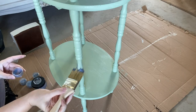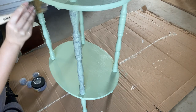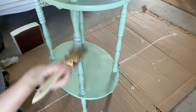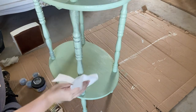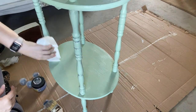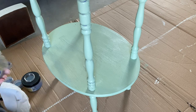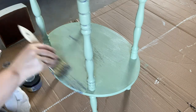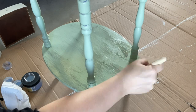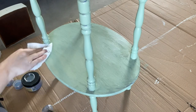When my clear coat is dry, I'm coming in with Dixie Belle's Grunge Glaze. I'm working it into the different crevices on the spindles, and this is going to give our piece an antiqued look without being too dark. I'm going to be brushing it on and then coming in with a paper towel and wiping back some of the excess, repeating the same steps over the entire project. Something to keep in mind is that if you have a lot of brush strokes, glaze or wax is going to highlight this. I don't mind that because we are going for a vintage look for this piece, but if you want a more perfect looking piece, this is probably not something that you would do.